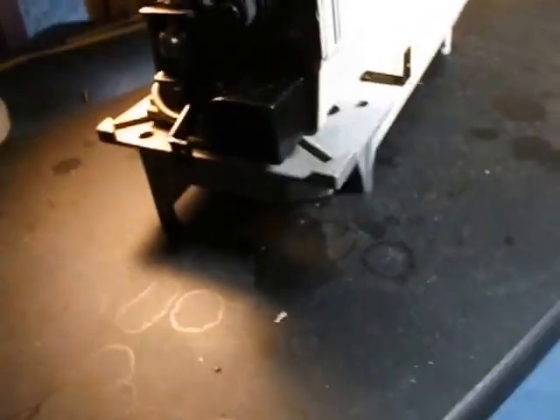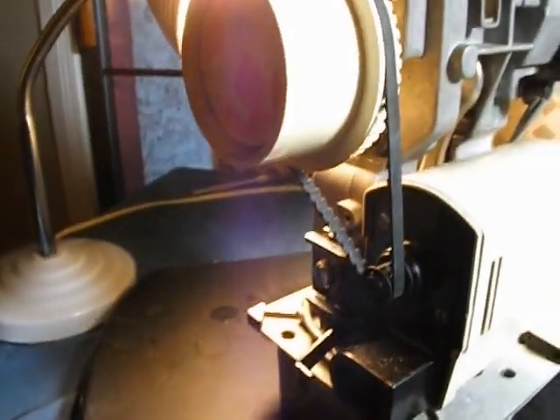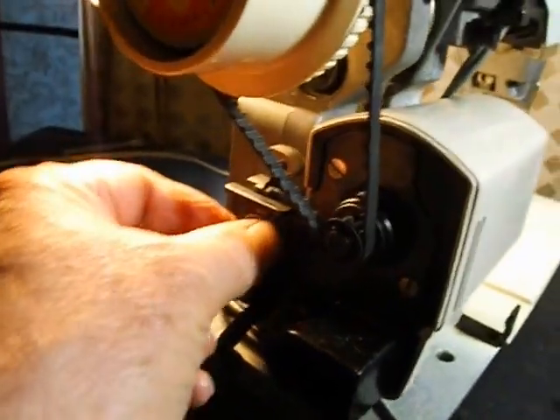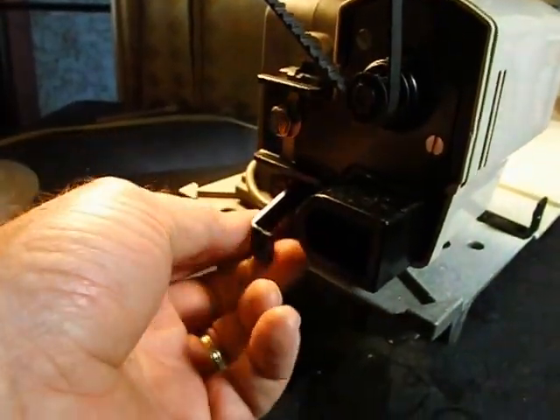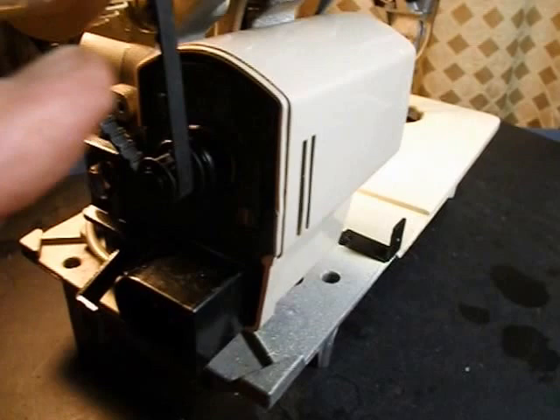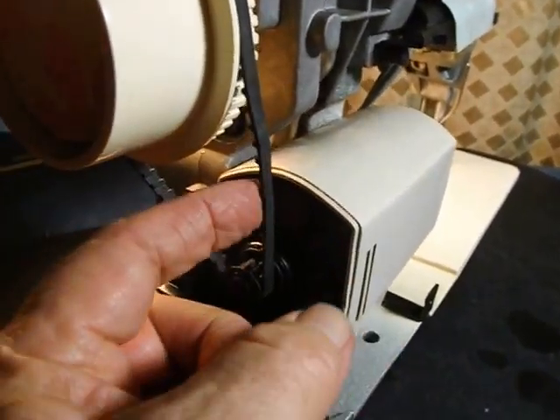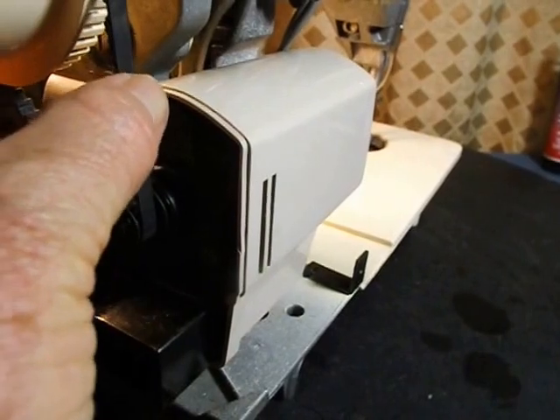Continuing around here, you see the nice motor. I've got to look up the amperage before I list it for sale, but I think it's about 0.6 amp, keeping up around 0.89. It's got a nice cog-type belt — I put some new belts on here. It's very easy to adjust: you just loosen the main bolt that holds the motor bracket, there's a little screw down there, and about an inch slot behind that bolt. You move it up to take the belt off, then slide it down and tighten it to adjust belt tension. I've got about three-sixteenths of an inch of give.